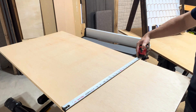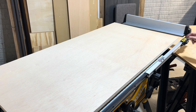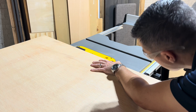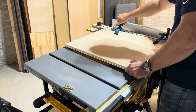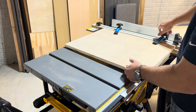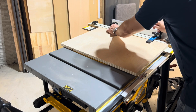This plywood was already cut to 24 inches wide and I needed to make a cut at 17 inches to make the base 17 inches by 24 inches. I find that size works well on most table saws, however you want to build the base to accommodate the size of your table saw. For example, if you have a compact table saw you can adjust the measurements to make the sled smaller. If all sides are not square and you need a perfect straight line without a joiner, check out the straight line jig that I will link in my table saw playlist at the end of this video.